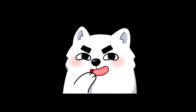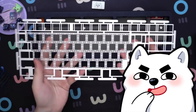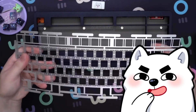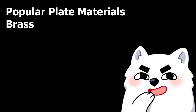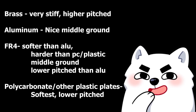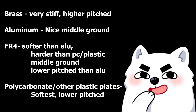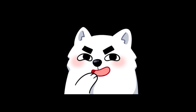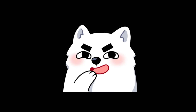Now that we know what PCB to get, let's choose the plate. The plate itself has a pretty big effect on the feel and sound. The most popular plate materials in the current keyboard meta in 2022 are brass, aluminum, FR4, and polycarbonate slash other plastic plates. Brass is pretty stiff and higher pitched. Aluminum is a nice middle ground. FR4 is softer than aluminum and harder than PC/plastic — a nice middle ground but slightly lower pitched than aluminum. Polycarbonate and other plastic plates are the softest and most lower pitched. I personally like aluminum or a plastic plate such as PC, but if you want that low-pitched thock, just go for the PC plate.